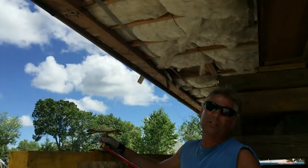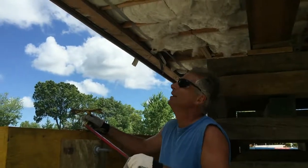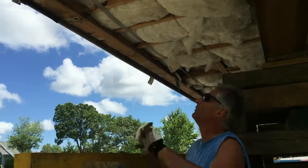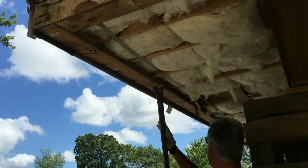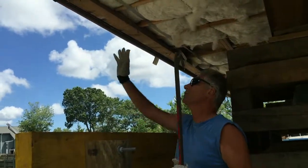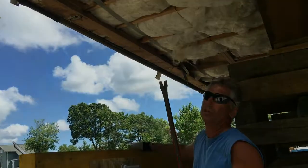So we're moving to a different location on the house. It was just a minute ago that I took down that sill plate on the opposite side. There's additional sill plates that need to come off around the entire house. So I have the sill plate here on this end of the house, although it's not in the way of this beam because we've now created a cantilever situation for the joists. It does need to come off for the future work that we need to do.